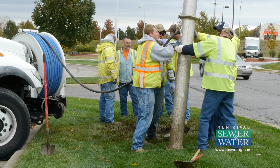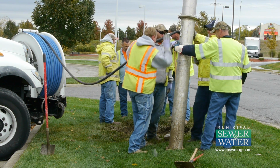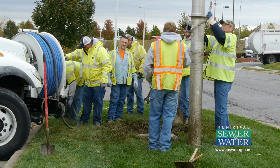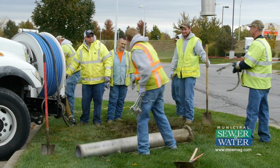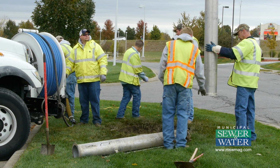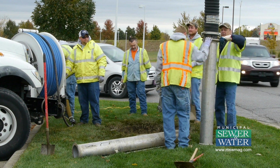For the last 3 years, instead of contracting out root control, we have implemented foam application into our jet cleaning trucks, which includes the guides and getting a chemical state license for the herbicide that is in it. That product is what we've been using for the last few years. It's called Vapor Rooter. It's with Douglas.